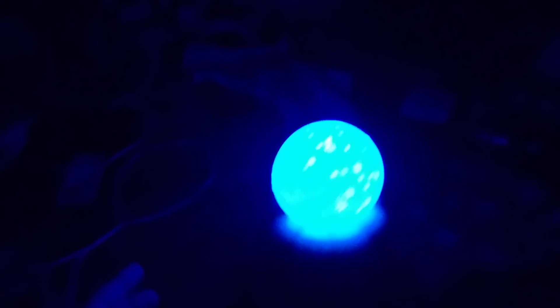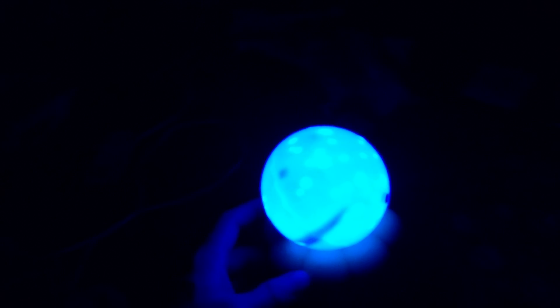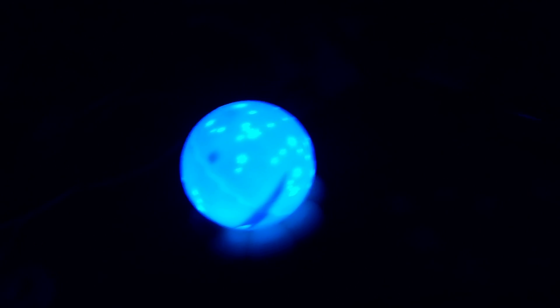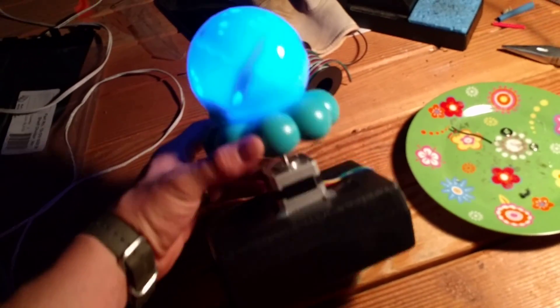I can vary the speed by just turning that resistor up or down. I thought this was probably one of the better speeds for stars moving across the sky. They move ever so slowly — about one step every 150 milliseconds — but they are definitely moving. It's variable, so that is my galaxy spinner, made with a silent stepper controller that makes zero noise.